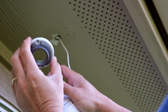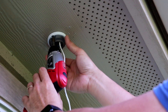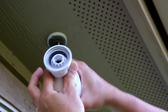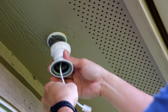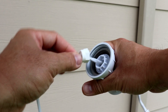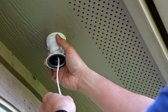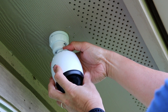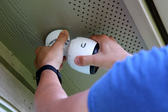For the G4 Pro 4K camera installation, first unscrew the mounting base from the camera by turning it counterclockwise, thread the Ethernet wire through the base, and screw the base into the ceiling with two screws. Unscrew the camera body from the adjustable base to connect the Ethernet cable. For proper weather sealing, there is a rubber gland that you need to feed the Ethernet cable through before it sits on the adjustable base. Screw the adjustable base to the mounting base, plug in the cable to the camera's Ethernet port, then screw the camera body back onto the adjustable base. Position the camera where you want it to monitor and use the tightening tool to lock it in place.